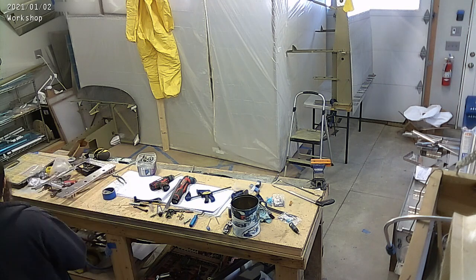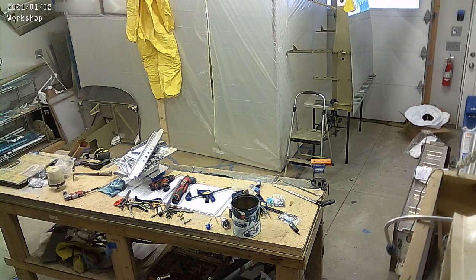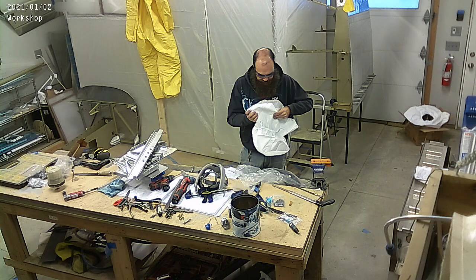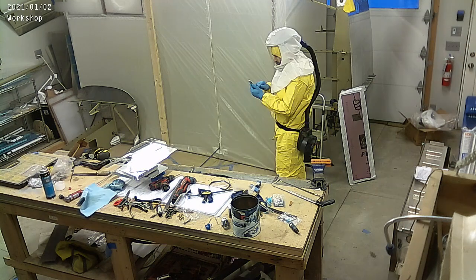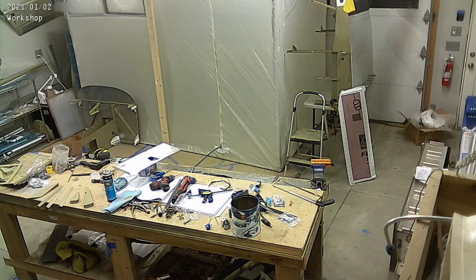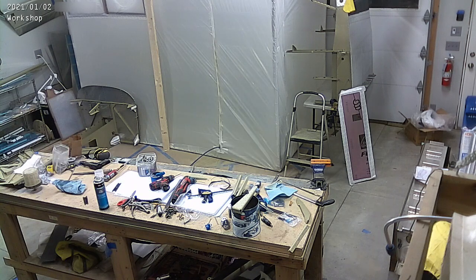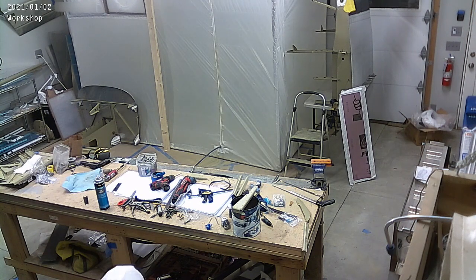The rear fuselage is where the passengers and the baggage area go and sort of the passenger feet go. But now we're working on the bits that go on the forward part, which is what you see attached to the firewall there, but below it. You'll notice that there's no skin on the bottom, no ribs, no bulkheads. So we're going to work on all of those little ribs that make the floor of the front side of the cabin, and all of the little bits that attach to the bulkheads, the spar carry-through, and there's also a sub-bulkhead there.